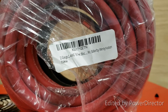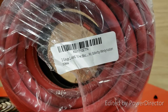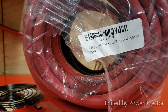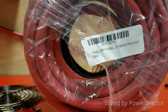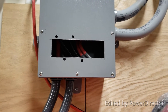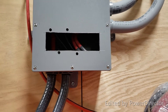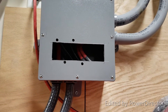The next upgrade will be to replace the existing 4-gauge wire from the distribution panel to the inverters with 2-gauge wire from Windy Nation, which should solve the heating issues. My plan is not to run more than 100 amps to each inverter, even though they're rated up to 125. I decided against DC breakers and will go with ANL fuses at the hub rated at 100 amps.